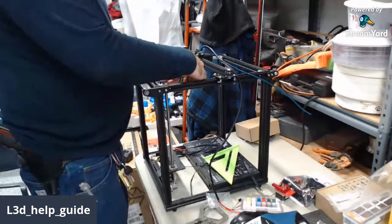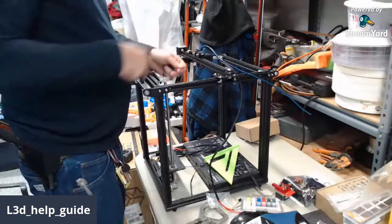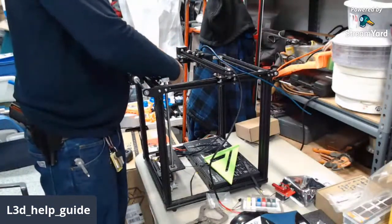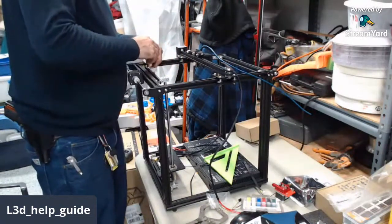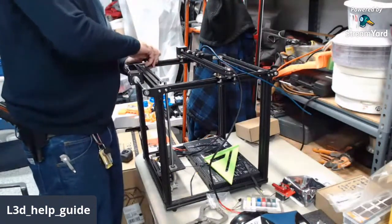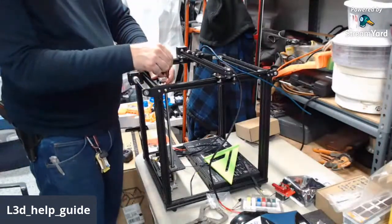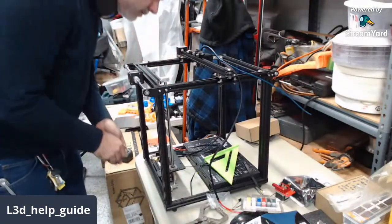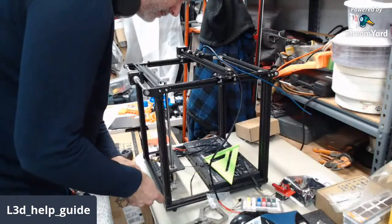And on these particular ones, it's not necessarily a weakness, but because they're through the web of the extrusion with their threaded parts, you want to get them snug, but don't lean into it, because there is a possibility to strip it, which is recoverable because you can do a through bolt, but I don't like to have things like that messing with me.